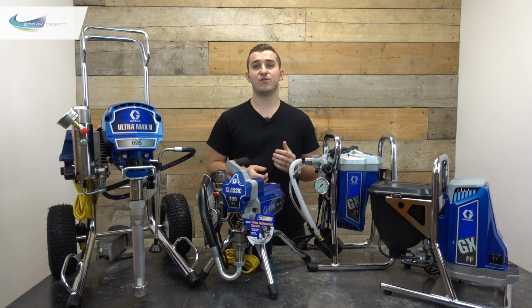We'd use airless units for larger areas that aren't necessarily super fine finish. The most popular use for them is interior and exterior wall and ceiling painting and interior trim work. Typically, airless units spray to a maximum pressure of around 3000 psi and can really cover large areas quickly, but with the right spray tip you can also be very controlled.